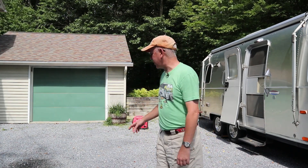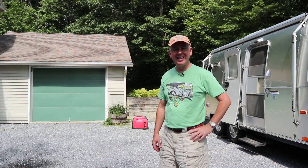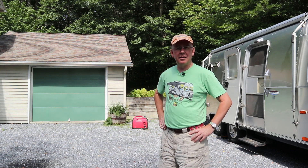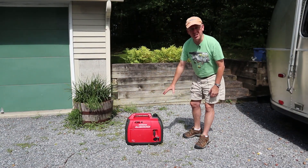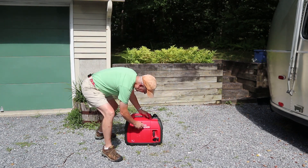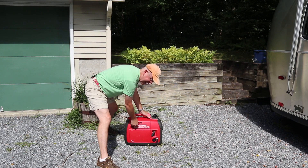It's another 90-degree day here in Vermont, so it's a perfect time to test our air conditioner off our Honda generator since having the Micro Air Easy Start installed. The starting amperage was around 16.7 amps. We have an older Honda EU2000 versus the newer EU2200, so it could be right at the limit for a 2000-watt inverter, but we'll give it a shot. If it doesn't work it'll just trip the breaker at the generator — it won't hurt the air conditioner. The breaker says 20 amps, so at 16 we should be good.